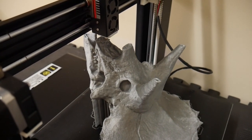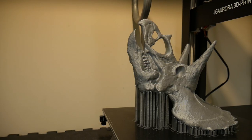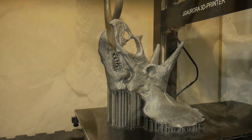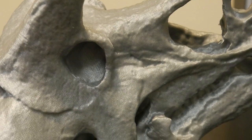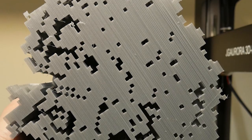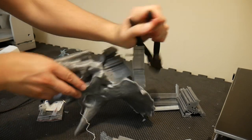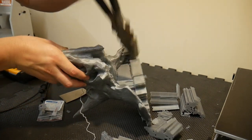My final test was the Scan the World Triceratops skull edit, scaled up — one of my favourite difficult-to-print models. This thing took over two days to print, but the results are well worth it. I actually even had a power outage, had to pull the power and reconnect it, and you cannot tell where it happened — it was somewhere up towards the top, perhaps one little line, almost impossible to see. The PLA supports worked really well and were fun to remove — they stuck to the print surface great. My tolerance test gauge was a complete failure though — I'll reprint it and share results on Twitter at makersmuse.